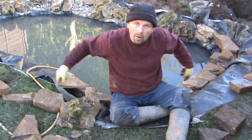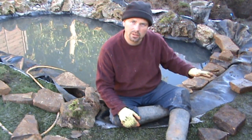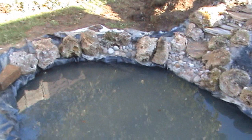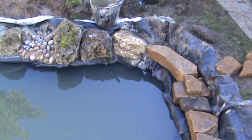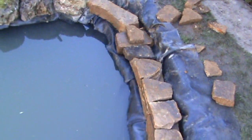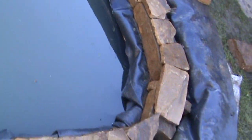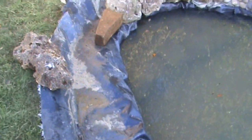We're going to be building that around the inside of the pond where the big rockery stone isn't, and that'll give us a nice solid side of the pond to stand on. We've got the rockery stone round the back edge of the pond, mixed in with a few cobbles and so on which are cemented in. We're going to bring out a very short dry stone wall, basically just two, possibly three stones high, all the way around the inside of the pond. This will actually be mostly underwater. We're going to take that all the way around to meet up with that rockery stone - we may put one or two big rockery stones in the middle of it, I'm not quite sure, I'll see how it goes.